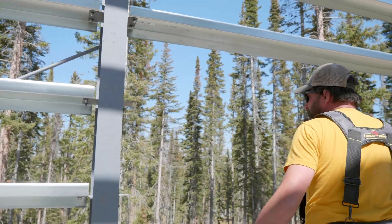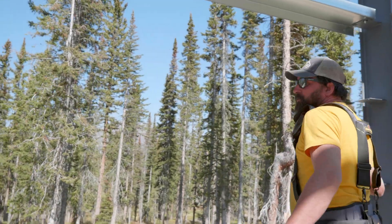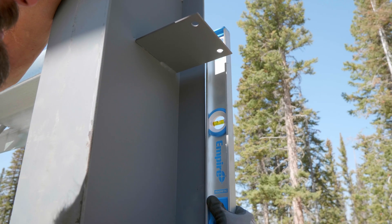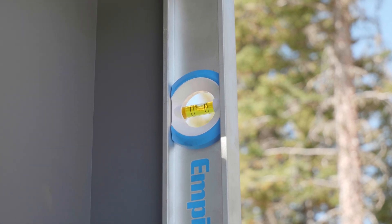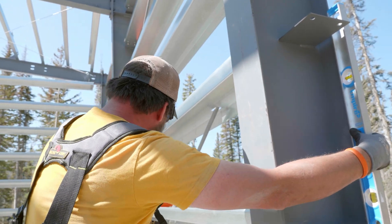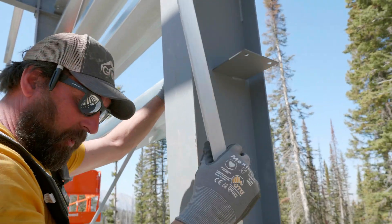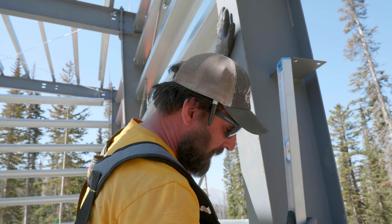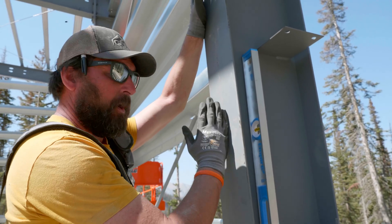What we're going to do is start tightening because the frame needs to come over to our right. We can tell by looking at the level it's going to be quite a bit off once we get up to the top. In order to fix that, we're going to start using the bottom base and pulling over, going back and forth from this bottom to that bottom as we bring both over. When you're checking level, especially on a three-plate or a welded I-beam made in the shop, we don't want to check level off of the web.